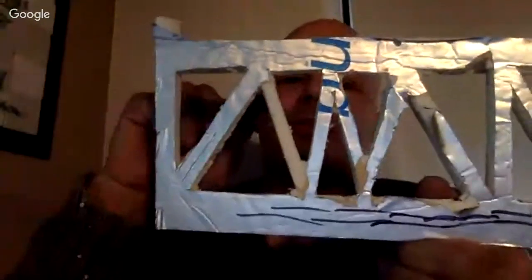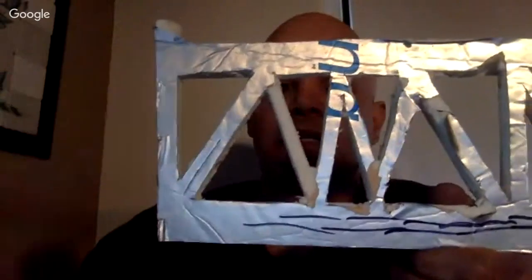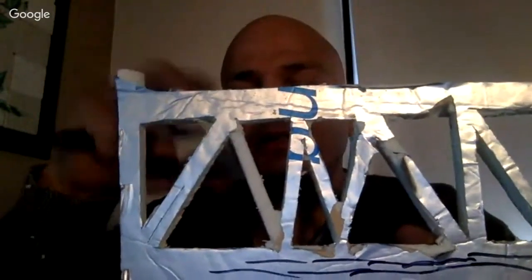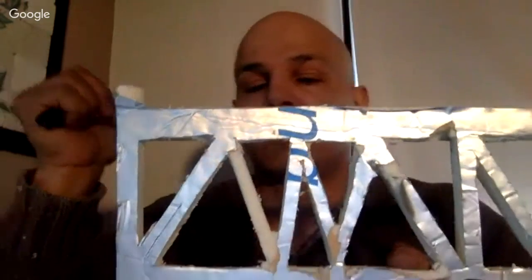And so if this is designed to go this way, everyone that thinks it should go down number 11, including me, would think that it should go down number 11, transferring the loads in a reversal pattern, but this is a people pattern. This is 50 pounds per square foot, I think it roughly is. I don't know how many people are going to be on there. They had events there, and you could probably pack this whole thing wall to wall and easily exceed your 50 pounds per square foot with the way people weigh these days.